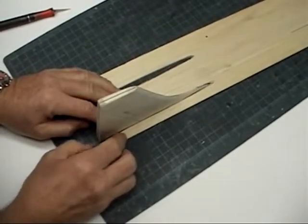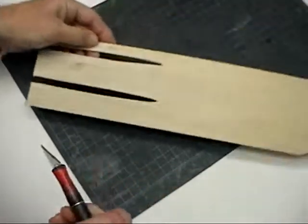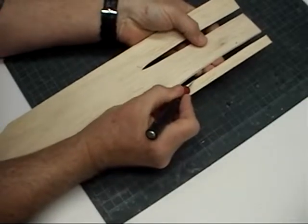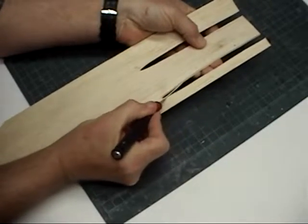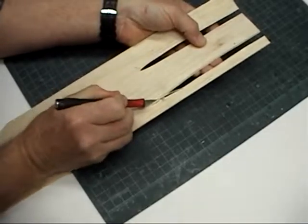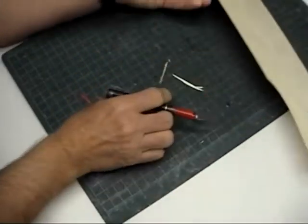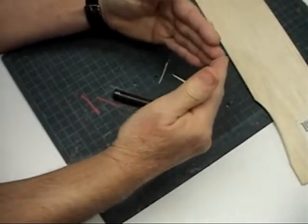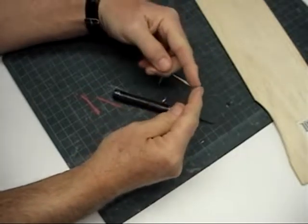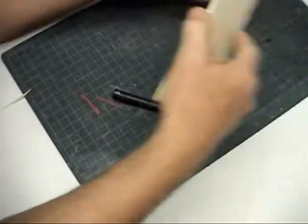This is real close to being what I want, except what I'm going to really want on here is up in the front. When I actually do cut this, I want to have this become part of an angle. And the reason for that is, if you've ever cut 2 pieces of molding, you know what happens is you want to relieve the cut so they just touch on the very front. You want to get rid of all the material in the back. It's easier to make a nice joint there.